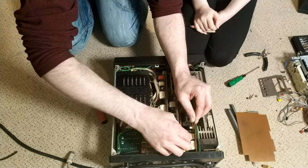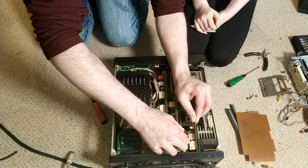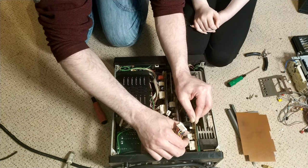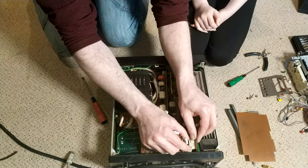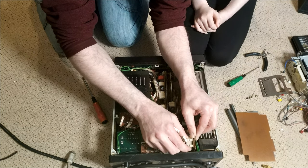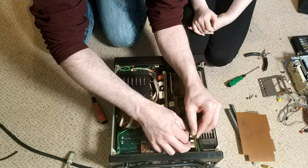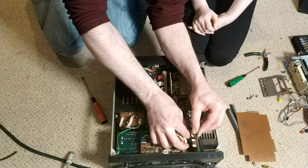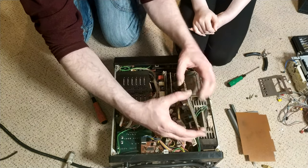That's right, so that's a bit of a Sony thing. Generally, when you take a board out, all the connectors are identifiable and unique. Yeah, so if there's one that's the same as it, it's probably going to be a different colour. That's right, and you match it up to the colour of the socket that it goes on to, so all their different shapes. It's not that common in consumer electronics to find that, so Sony seem to be very, very good. Let's not break it whilst we're at it though.